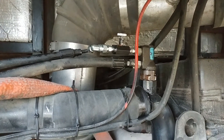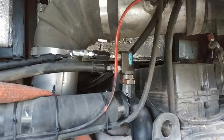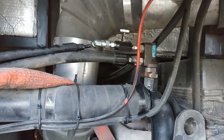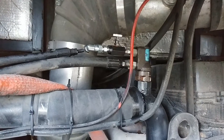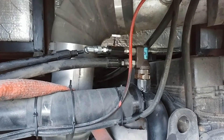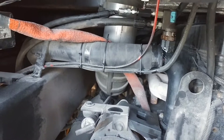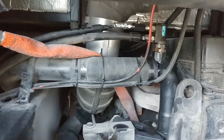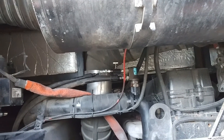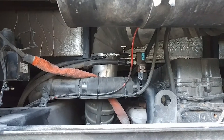You might go with a quarter-inch if you want full adjustment where all the way out means the fan doesn't come on at all. But it seems with this eighth-inch valve, all the way open, the fan will still run slowly — and that's just going to be the sweet spot for the AC condenser and the charge air cooler. This is just at idle; I haven't cranked it to fast idle yet, but I'm assuming it'll be fairly slow since it really honked on when I closed it.